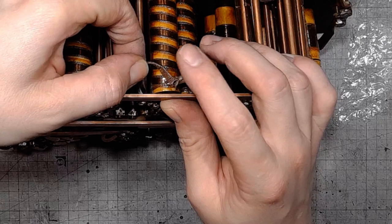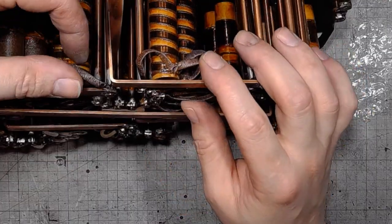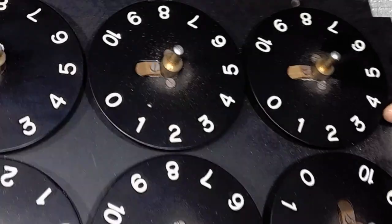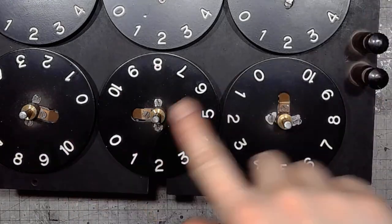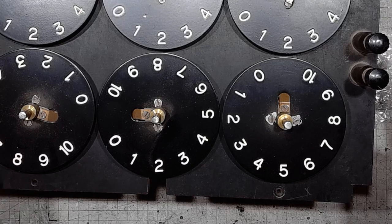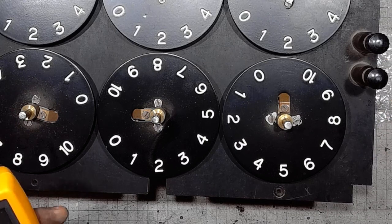This is insulated with cotton. So the bottom contacts, they connect the resistance decade. Those bypass it. So if I put a shunt on either side, I can lead the cables out to the device under test, or I can lead the cables out from both sides.